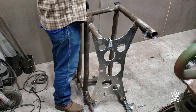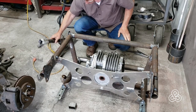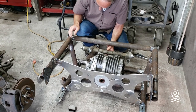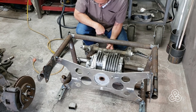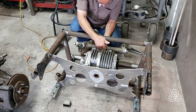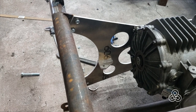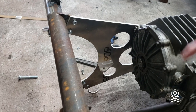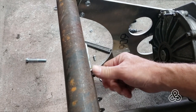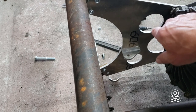Now here we are — my mistake. Got a clear problem taking that steering rack out, just showing you how it does not fit in there. The new theory is I need to be able to move it slightly underneath that tube rather than out to the face of the tube — somewhere about in here I'll be able to put it, tipping it at a slight angle to get that steering shaft going up towards the dashboard. If it's right about there, I still have about three quarters of an inch of clearance. With this differential setup, these gussets sticking out will have bracing coming back over and tying to the frame to stiffen it up so that we don't get the torque. That plate is just not stiff enough, so there'll be some more bracing added to it as well.